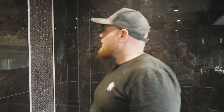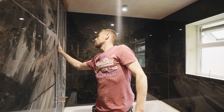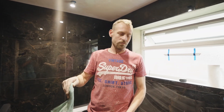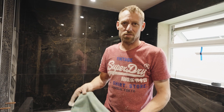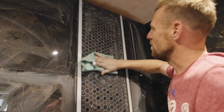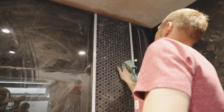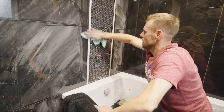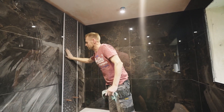And that is how to grout a mosaic tile. Now the mosaics are dry, we're going to clean them off. There's a final bit of dust left on the tile from the grout. You can use either kitchen roll — though it leaves a few little white bits — or best of all, use a microfiber cloth, which is what I prefer. Now the grout's dry, you just wipe off the dust that's literally just sitting on the surface, without ruining any of the grout. Wipe the mosaics down.